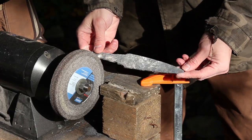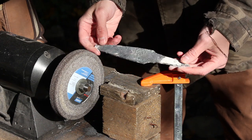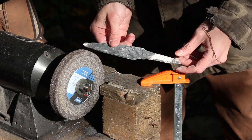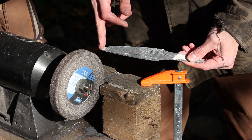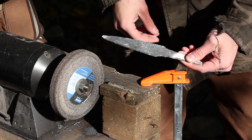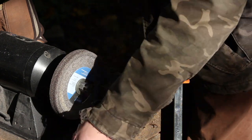Here's what the knife is looking like after it came out of annealing. Got a lot of fire scale on there. The game plan for grinding is: this is where the edge is going to be, so it will be kind of a spear point type shape — I guess it's a little more of a drop point — so I'm going to get going just grinding that out.